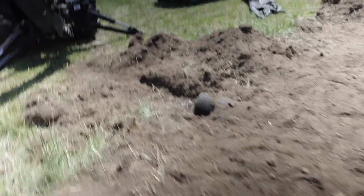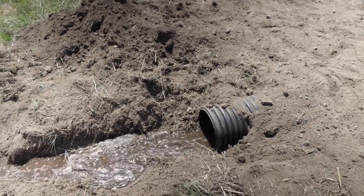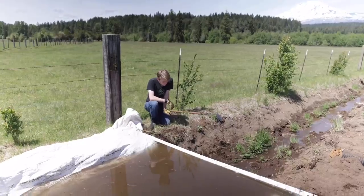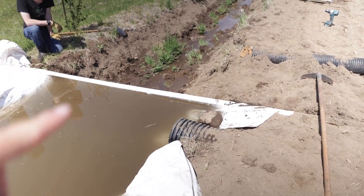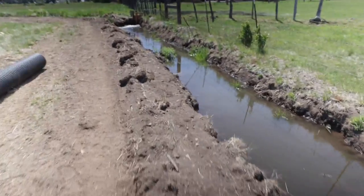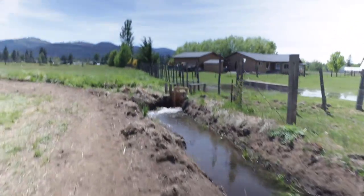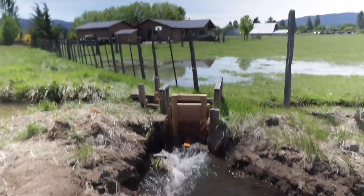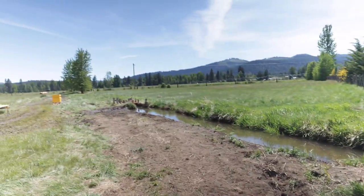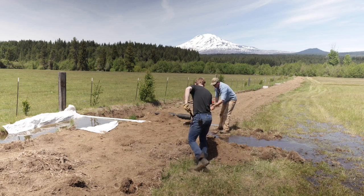It's gonna get sealed up with pieces of mud. We have achieved our goal. We're kind of learning here as we're going. I thought for sure a 10-inch pipe would be enough to handle that. No way. We had almost completely closed down the gate and we put a piece of 1x and that seems to be about right. That's about what we can get through a 10-inch pipe right there. I guess the good side is there's so much water that we're irrigating up there too, so we can do two at once. Okay, so let's grade this out and then we'll get set up for the gate.